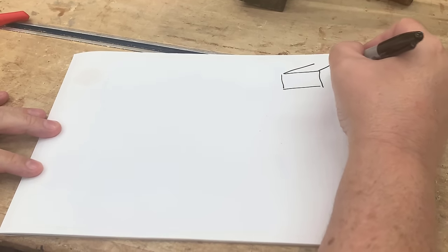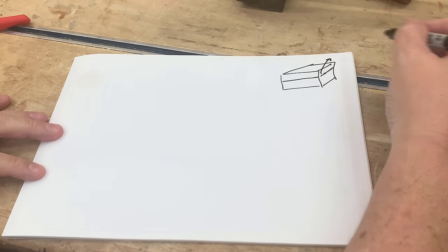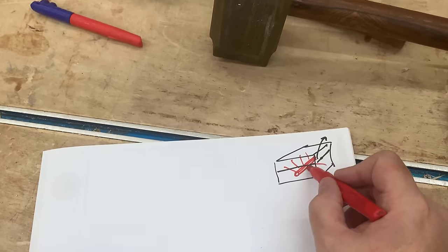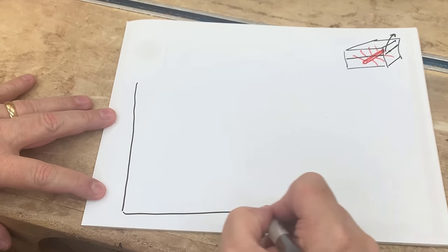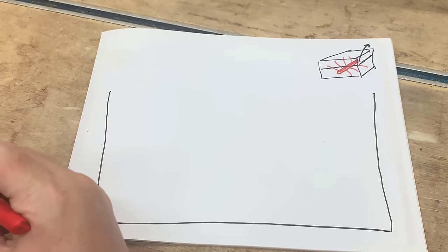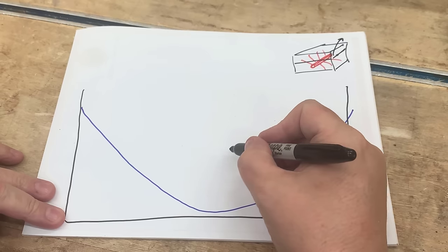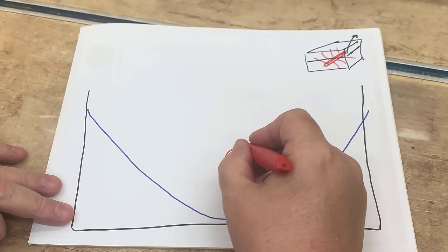Here's the basic idea behind the box. The lid lifts off backwards, and inside there's an ultraviolet lamp that shines light out in all directions. Many existing designs are just square boxes with up to 100x variation in UV output from one part to the other. In this box, I'm putting a parabolic reflective mirror in the bottom. The focal point of the parabola is five inches up from the bottom — that's where I'm going to mount the bulb.